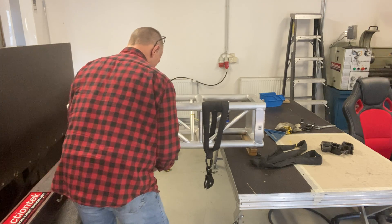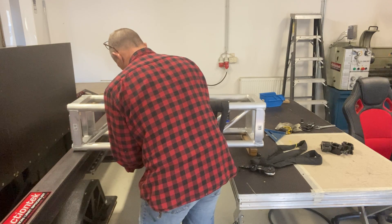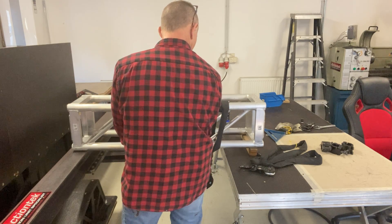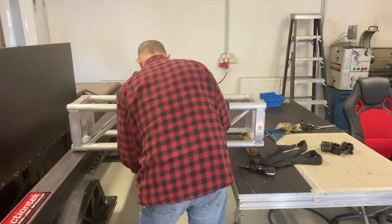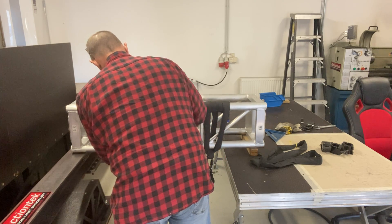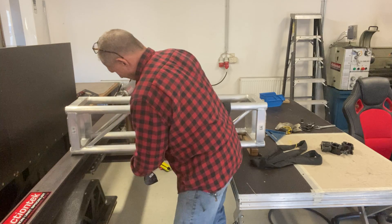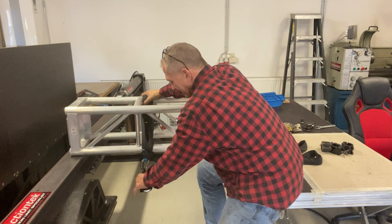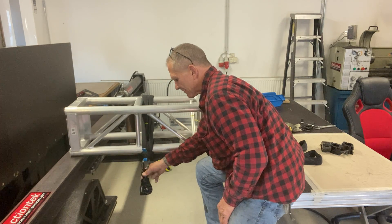Let me just give me one second to change one. A little tight here, but that's the way it is. So I flipped this one, and you'll notice that now the choke is in the direction of the force, so this pulley is going to fleet this way. This choke is going to tighten up — here's your cross of your choke, and it's back choked against that. There's where your pulley is going to fleet. It's tightening up the choke here, and it's around the second part of the cord.